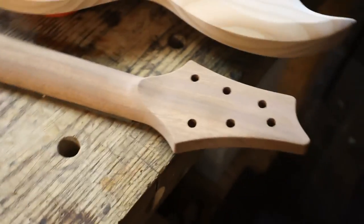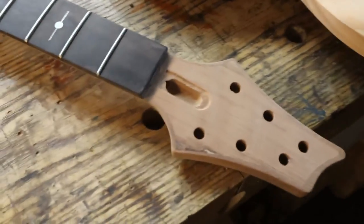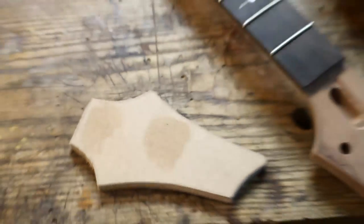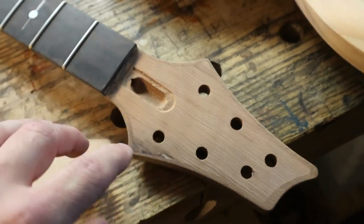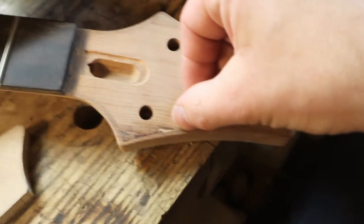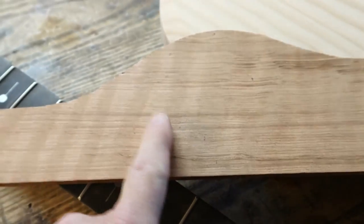So, yeah. Now, before I get on to other matters, this happened, and that is going to need a repair. So the clamping, I used this, sorry if that's giving people motion sickness, I used this to clamp it down, and it just wasn't strong enough. I only clamped in two places, it didn't push down in the corners. It was a rushed thing at the end of a night, I seem to recall. The beautiful thing is I do have a lot more of the wood, and the repair is going to involve actually cutting along one of the grain lines, removing that material, not in a straight line, along the grain line, and then finding the same grain pattern in here.